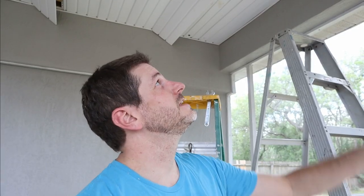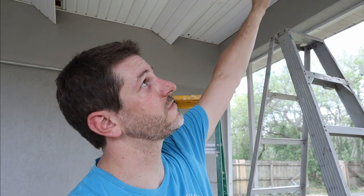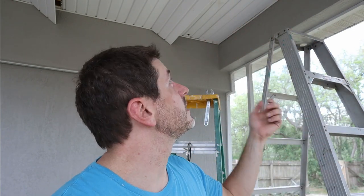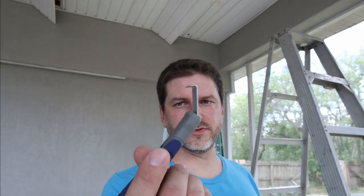The hardest part of this whole process is getting the soffit to snap back together - there's sort of an art to it. I'm using this tool, which I can put a link in the description, but you can get them at Lowe's or Home Depot. You basically have to pry it back on the little lip while pushing up, and then let go and it'll sort of catch.